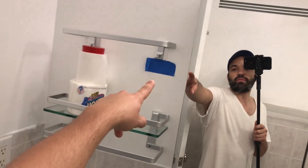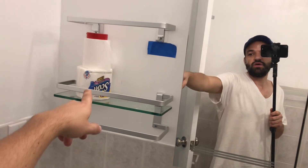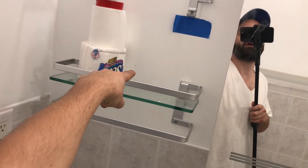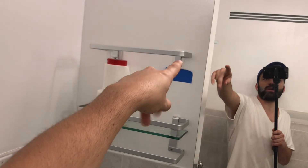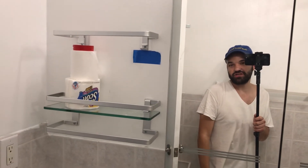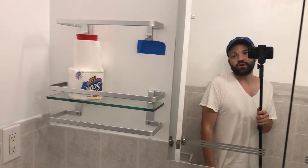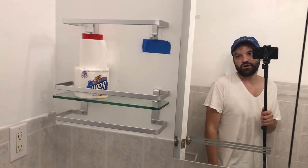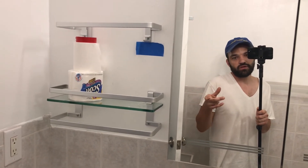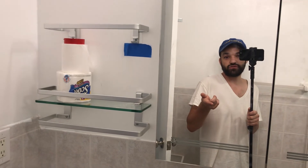All right, I'm back and I started installing the smaller shelf. I leveled it out and put the bracket on top. I marked the center line with tape — that's my reference line for the bracket height. I drilled a hole and it feels like I hit a stud because there was wood on the drill bit when I pulled it out. I pre-drilled with a very small bit, under one-eighth of an inch, about half an inch into the wood just to relieve pressure.